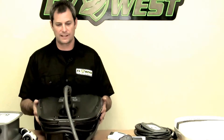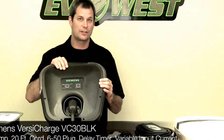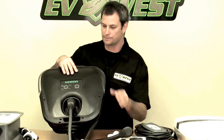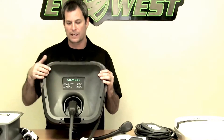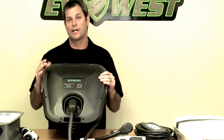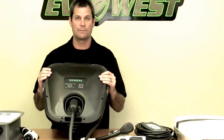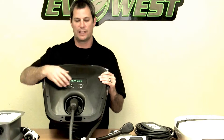This is one of the biggest ones we sell — the Siemens, and we really like this one. It's a super feature-rich charge station rated at 30 amps. It comes with a NEMA plug built in — I think this is the 14-50, which we call a welder's plug around here. On the front you have two buttons: one for on/off and one for a timer delay, which is really convenient. We know a lot of the new cars like the Volt and the Leaf have time-of-day billing so you can have it turn on after midnight for your cheapest electric rates. You can walk up, press the button twice at eight o'clock in the evening, get a four-hour delay, and be certain your charger turns on at midnight and doesn't leave you stuck in the morning.